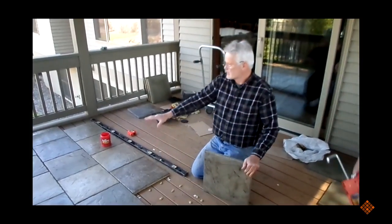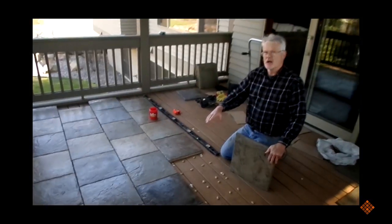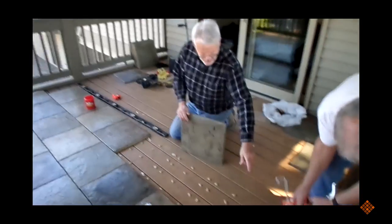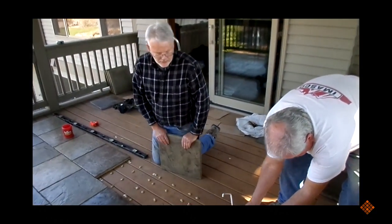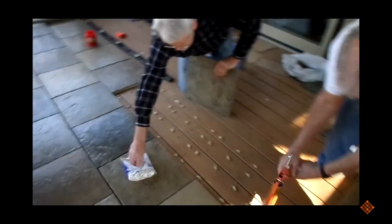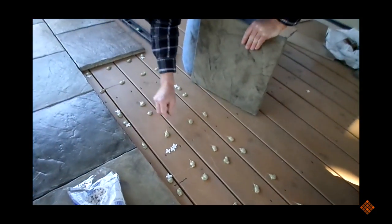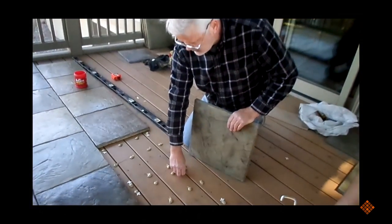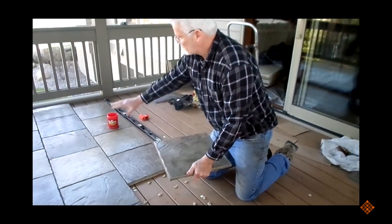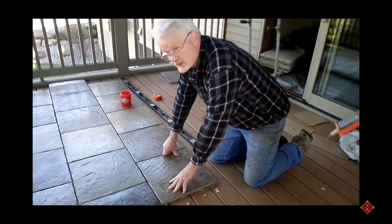You can see we've got a bunch of floor set and we're just working across fast. We have all of our lines mapped out for the running bond brick pattern, and Mike here is putting blotches of polyurethane glue on — we're using blobs instead of a running bead because we're going over an existing deck. We're also spacing them up with one spacer in each corner to keep the tile off the wood just a little bit so we have an air space and don't have water sitting on the wood rotting it out. Then just take your tile, pick different colors so you don't get too much of one color in one spot, put it in place, drop it, adjust it.